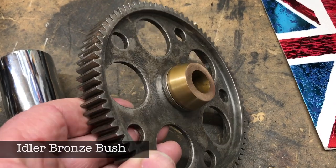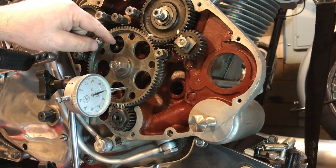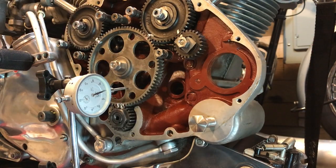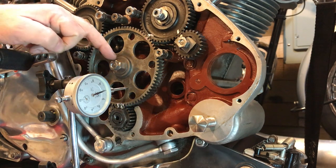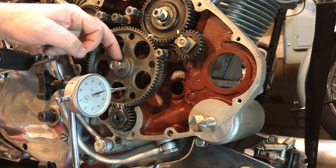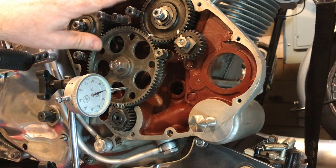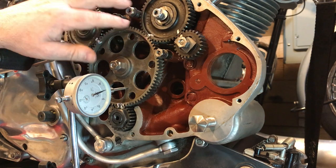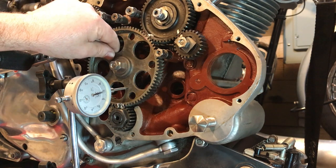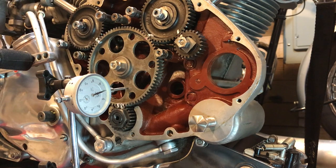I ran that on some very fine sandpaper so it looked like glass, and what we've accomplished is about five thousandths clearance here. I've just got an oversized nut here with a new thrust washer and then the nut on the end to simulate the locking plate going on, but I'm very happy with that - that's a really nice end play position for that idler.